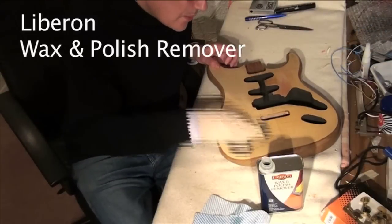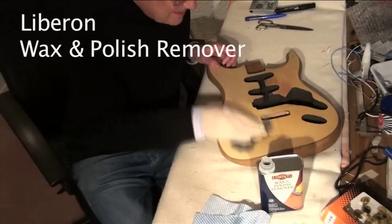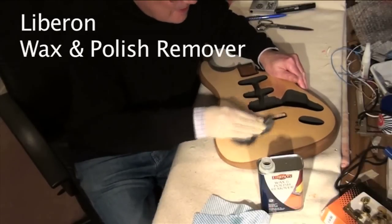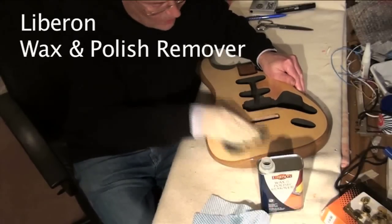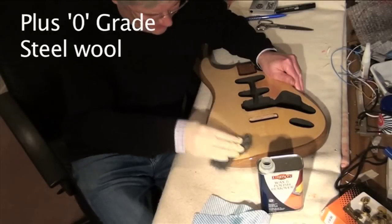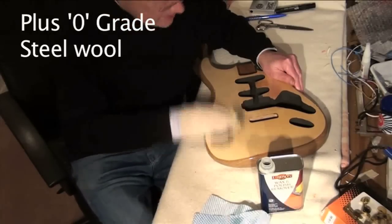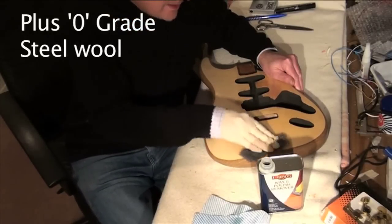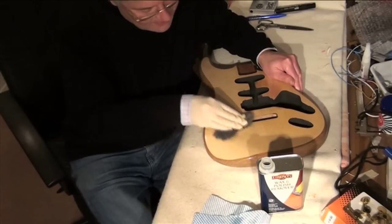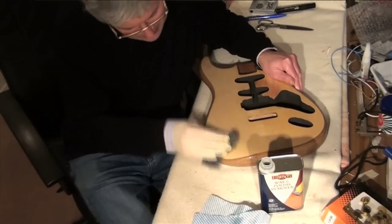I hope this is of interest to you. Enjoy! I'm working with the grain here, basically just trying to soften up and degrease the whole waxed or oiled surface. It seems to be doing the trick, but until it's all thoroughly dried out and then on a small sample area I've applied some stain just to see if it will take evenly, I don't really know whether I've done the trick or not.